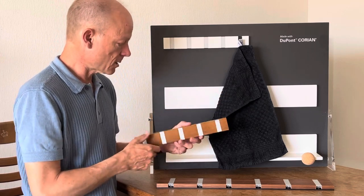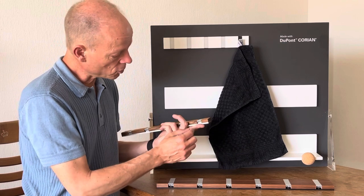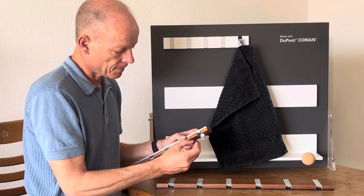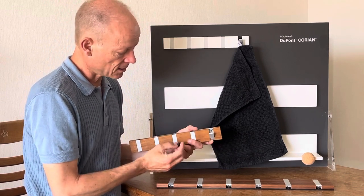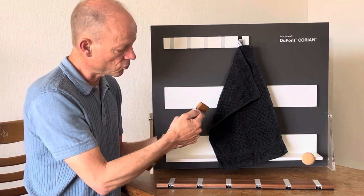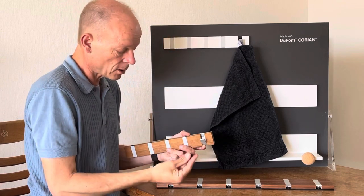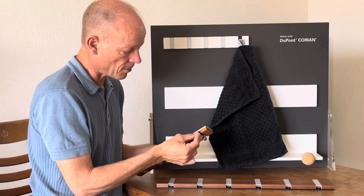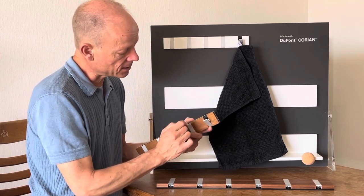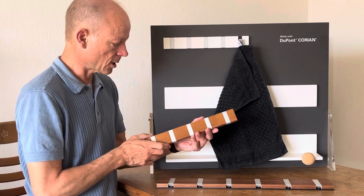The way this is fixed — which a lot of people have asked about — is that you open the spring hook and then take off the small piece that is behind here. Then you have a hole where you can put the screw in from the front and attach it to the kitchen or bathroom wall. Then you take the small black rubber piece and put it back on. That way, your screws are hidden.